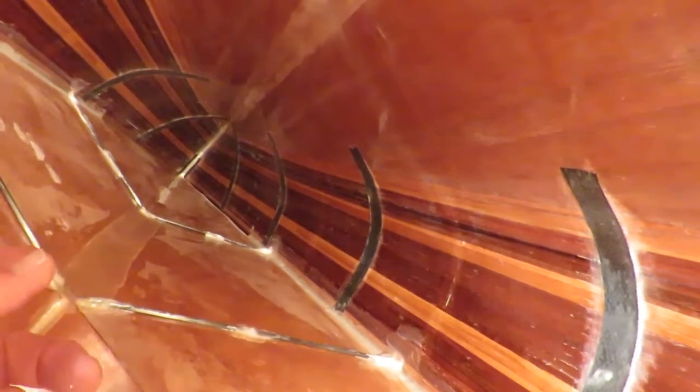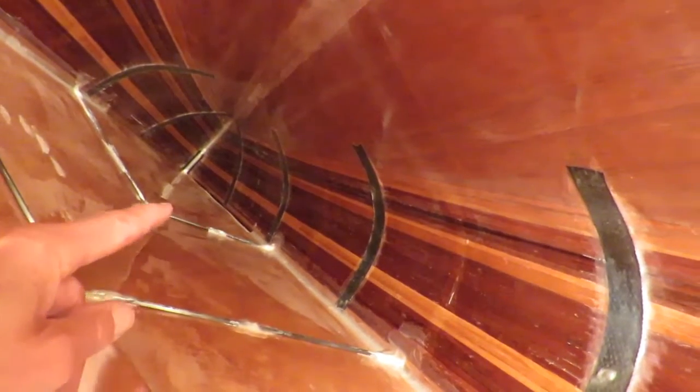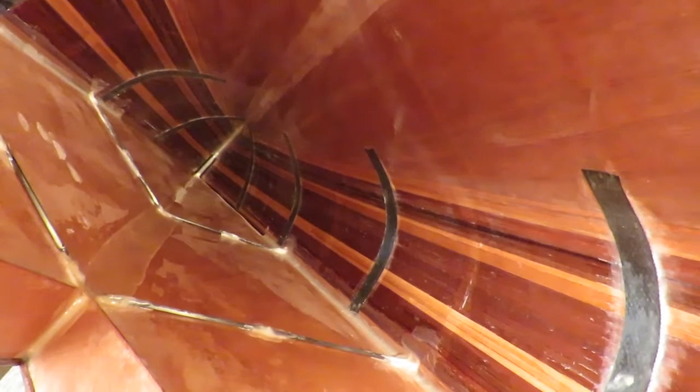And now, what we're working on this morning is on the downside there. We have it tipped, so when we pour epoxy into that V between the deck and the hull, right along this line here, that epoxy will form a bit of a fillet. It's just liquid epoxy, but it'll fill in any gaps there and coat the wood and help to secure the deck to the hull. Although it's pretty well secured with what we did on the outside. This just gives an additional reinforcing.